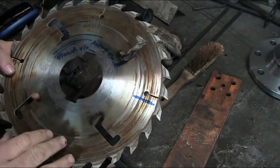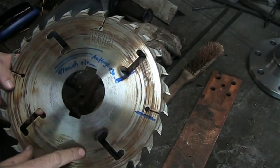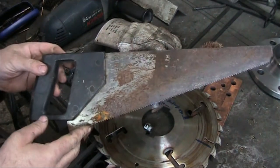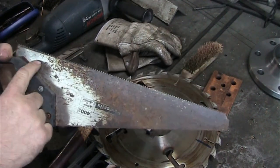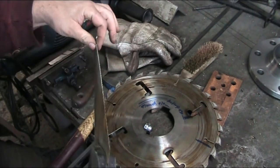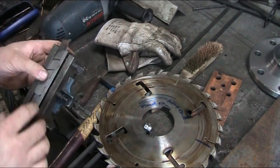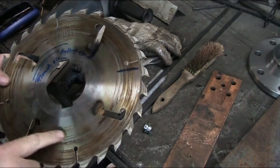The same thing applies on band saws and other gang saws, which is just a long saw. You have this in your hand saws too. Like this one — you'd have a benchmark running somewhere parallel to the blade in order to keep the tooth line nice and straight as you're looking down it. This one here has two benchmarks. It just depends on the type of saw blade. The more material you have without these cutouts, the more important that benching the saw becomes.